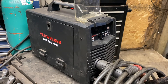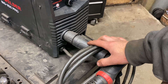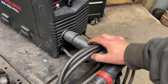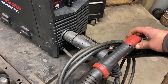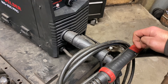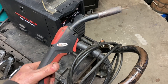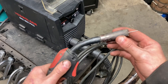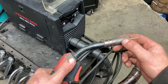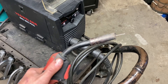Here's the machine. It's got a clean look to it, especially for its price. It has a Euro connection style MIG whip. These are replaceable and Yes Welder themselves does sell an upgrade for this — I am going to purchase that and try it out, and I'll probably do a review on that to see if it's worth the hundred bucks or not. The whip on this machine is on the cheap side, but that's what you're going to see with any machine in this price range. The cool thing is that the consumables are Lincoln and Tweco, so you can find them at your local welding supply pretty easily.